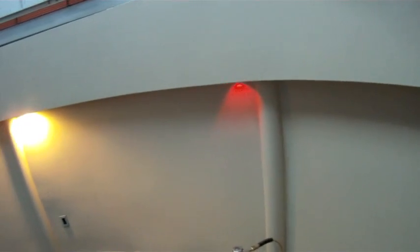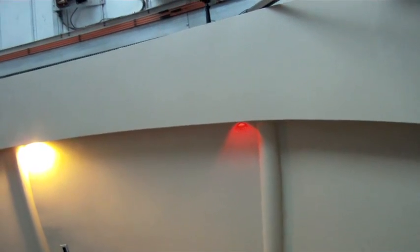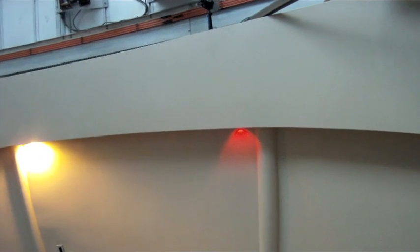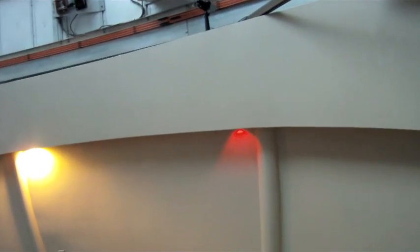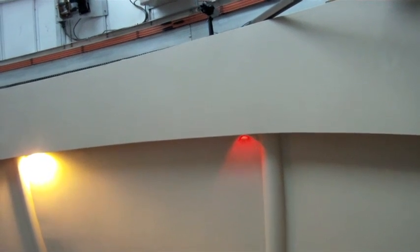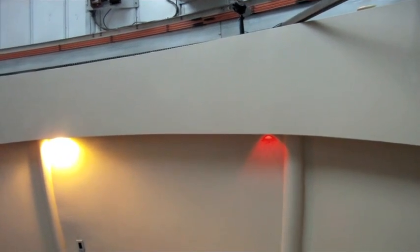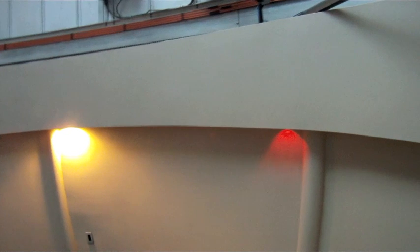Now, this is a typical kind of tank that you'll find at a welding supply store. Typically for a snow gun, you'd want to use a siphon tank, which would have a tube that goes to the bottom of the tank to draw the liquid CO2 out. For a normal tank, we can either flip the tank upside down or maybe even lay it on its side to get the liquid CO2 instead of the gas. And so we'll do that when we go to clean the mirror.